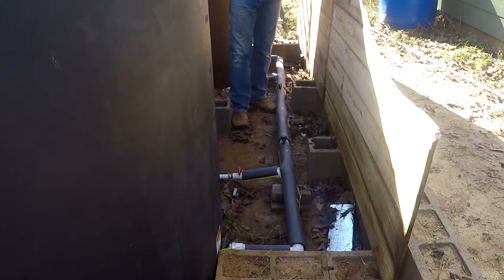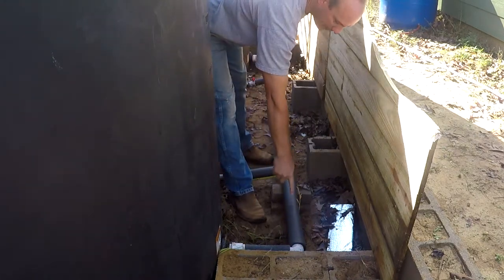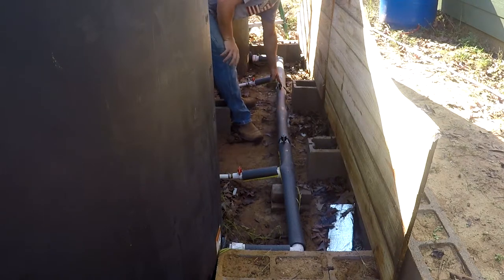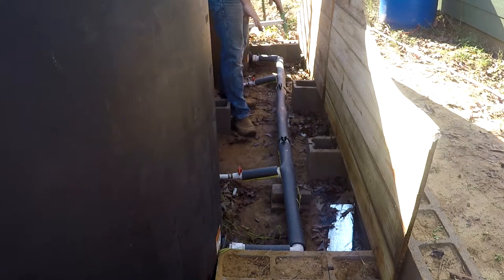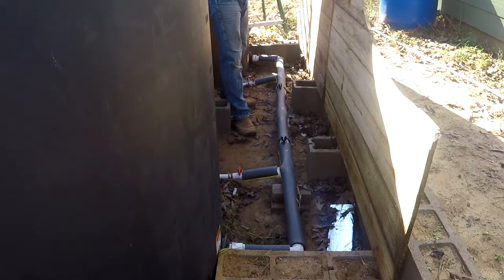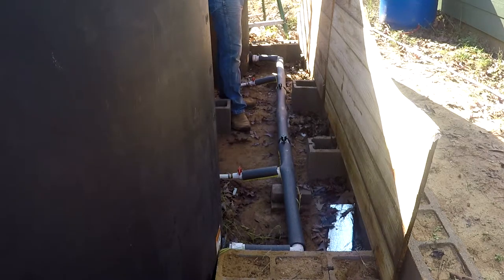Once the pump comes on, it draws water through the intake system, and the water comes out here, and I have a valve here and a valve here for each side. So currently both valves are open, these tank levels are even. If I turned off a valve and used the water, one tank level would draw down.